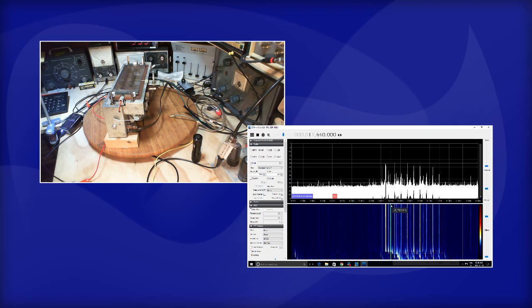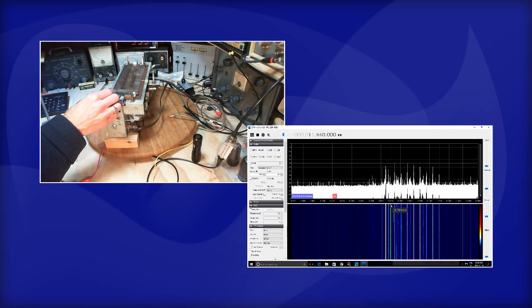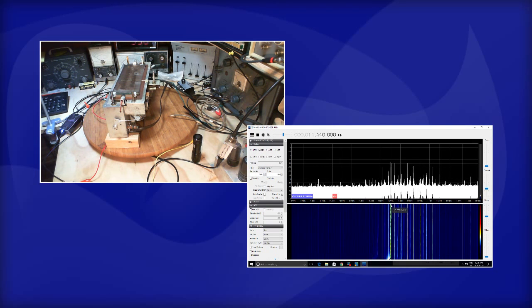And you can see something just to the left of it. So what I'm going to do now is tune the local oscillator until we see 10.7 here. That means the local oscillator should be at 110.7. I gotta go look. I'm gonna switch this whole thing again. It's a bit of a hassle doing this. Stop it first. Quadrature.